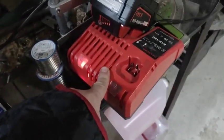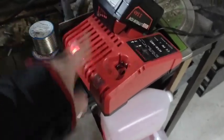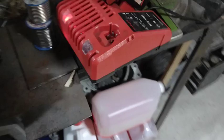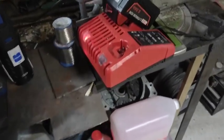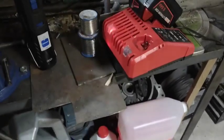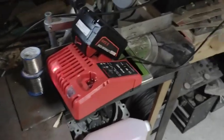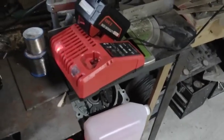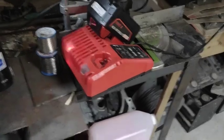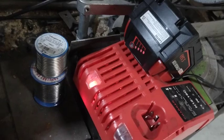Inside, I don't know. This one obviously has a flyback converter inside because this is a charger. Now, if I can actually power that, I can find out if there is an internal separate voltage to this, which there might be, and then use that. But I don't think they do. I think it just drops straight down from the rectified mains, which is about 330 volts, and it uses that on a buck converter, on a flyback converter. Sorry. So, not sure about that.